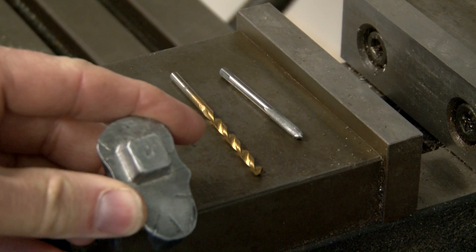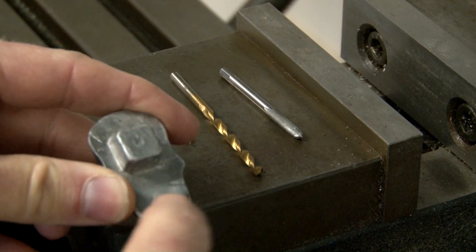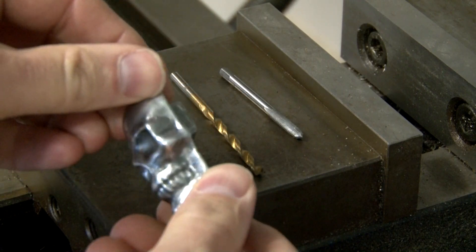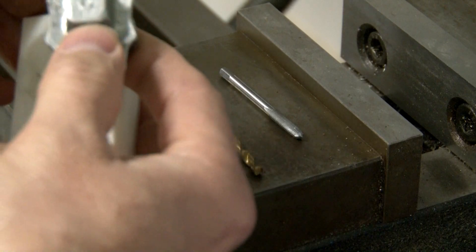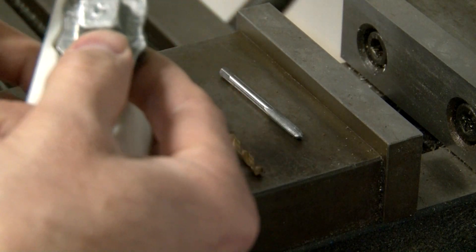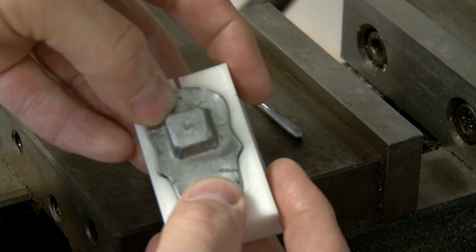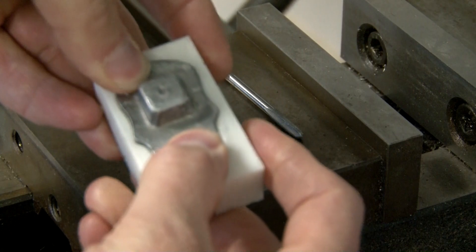The order of operation: I talked about holding this in a vise and it's an odd piece, so the way we're going to achieve holding it in a vise is to actually 3D print a negative of it. We'll put it in there like this, then clamp it up in the vise, and that way it will hold it well enough so we can drill it.